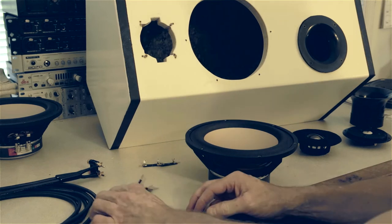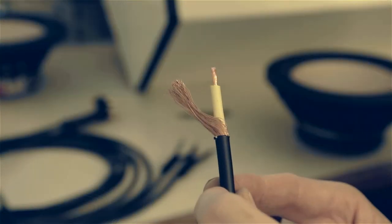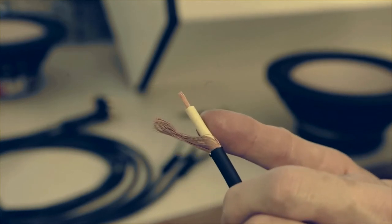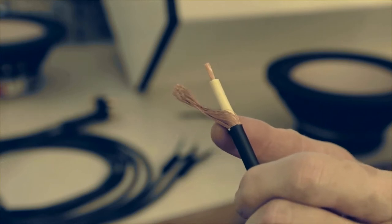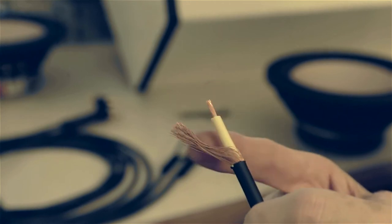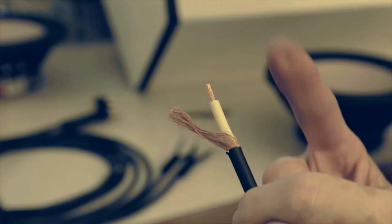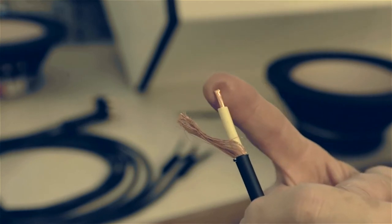Now the other wire I have is this Mogami. This is Mogami wire — it has a coax on the outside, and then you pull those strands back and you have this center insulator core with wire on the inside. So it's a kind of coax lead. One of the issues is when you run this wire, it's probably as many wire strands in the core, but it's not truly a balanced line. One of the ways around that is to double it up — have two of these and run the center core for plus and the outer one as plus, and run the other center and outer core for minus.